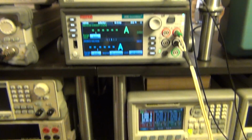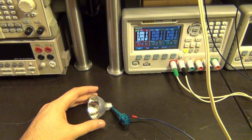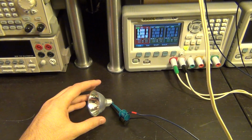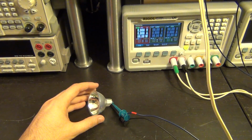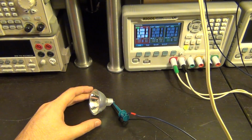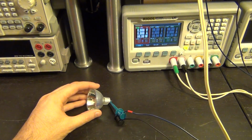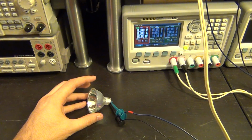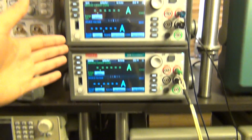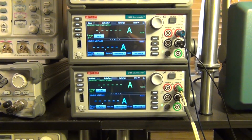at the top here is connected to this halogen lamp, which is a very tough load to drive, not just because it requires a lot of current, but also because its response is heavily time dependent due to thermal reasons. So at the beginning there will be a big inrush of current, and then the voltage will rise up as the filament gets really hot. So this is a difficult load to drive, typically with solid state devices. So we're going to basically drive it using these two combinations, and once I run the code, it'll become much more clear exactly what it's going to do.